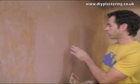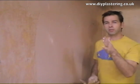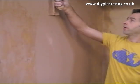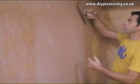The next stage is to flatten that first coat off. Give your trowel a quick clean. The sole purpose of stage two is to knock the ridges back, because if you don't and they've dried, your second coat will have to come out to that thickness to cover them and you could end up with a very bumpy wall. So it's a quick but important stage. This can only happen when the plaster has got tacky — sometimes you need to leave it five minutes, sometimes 15 minutes. Every wall is different, depending on how quickly the moisture has been sucked out into the backing coat behind.